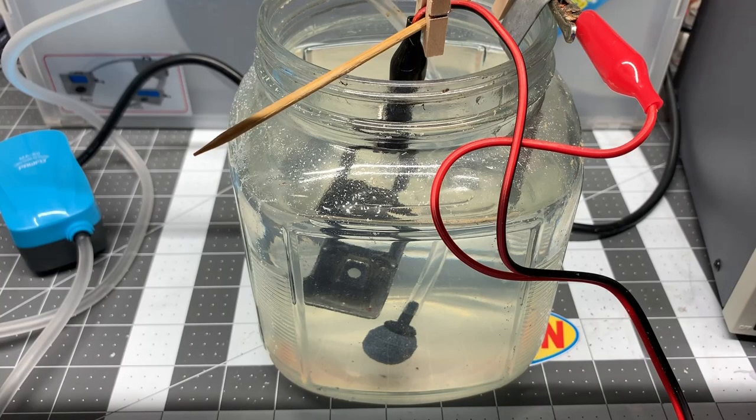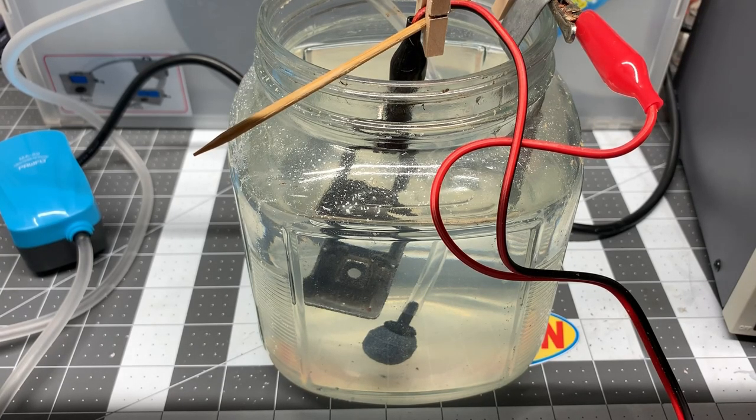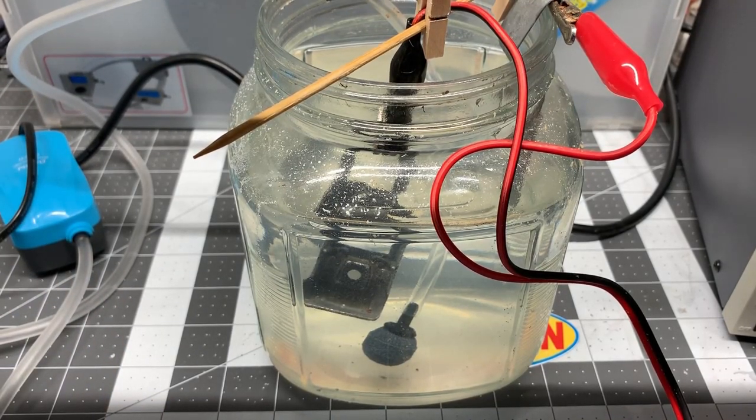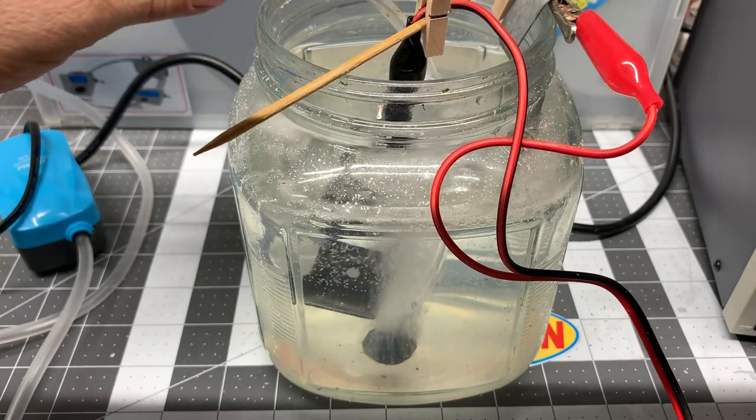Here I've got my zinc plating set up. It's a mixture of distilled white vinegar and some sea salt. Now, we have a power supply hooked up to it. It's set to 1.5 volts and 0.36 amps. If you look real close, you can see the bubbles coming off the car. But if you don't address those bubbles, they could rest on the car and you could definitely see that in your pattern when you finish your zinc plating.